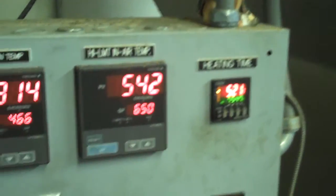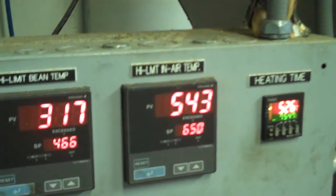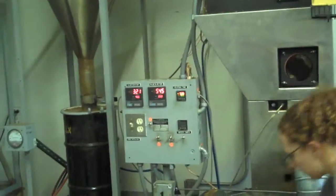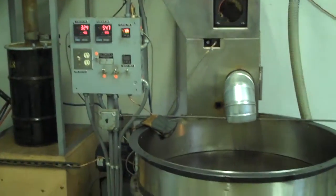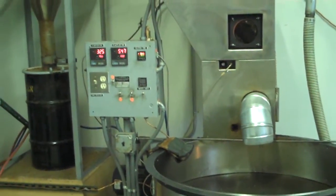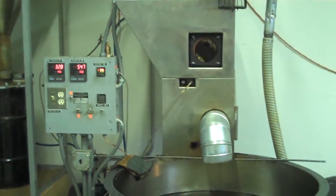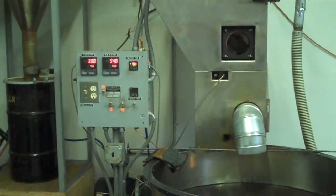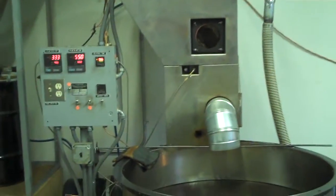So what we'll do is, really not a lot to adjust gas pressure, but we don't recommend doing that on the first roast. As I mentioned earlier, these are very thirsty roasters for gas consumption. Even though we're roasting about twice the speed of a normal roaster, we're using 3 times as much gas. So we're still coming up 50% on gas consumption compared to a typical radiant drum roaster.